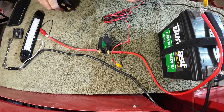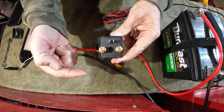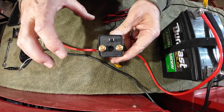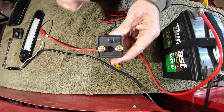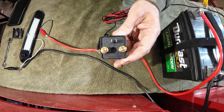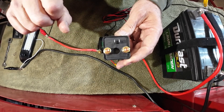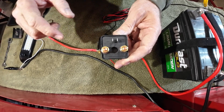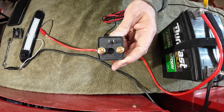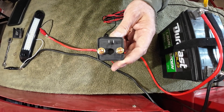In our truck application, we use the relay with the diesel pickup — we had our aux beam switch inside the cab. You just touch a button, that powers the aux beam switch controller to send current to the relay. In the cab you hit the button, it makes the connection, it powers the inverter. And when you shut the truck off and take the key out, it powers down the aux beam, which automatically powers this down — so there's no chance of parasitic drain.